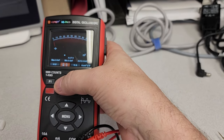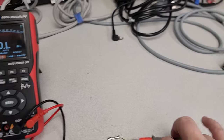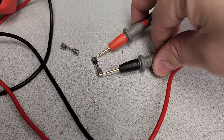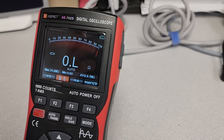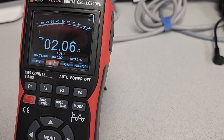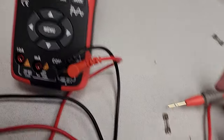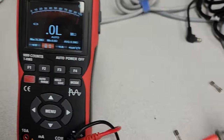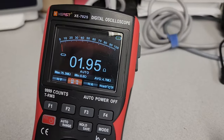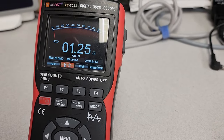Ohms is an actual measurement. So let's go ahead and pop this over to ohms. Here we go — look at this fuse. One ohm, two ohms. You see that? It's jumping around. Let's set that fuse aside and get the next one — and yeah, this is actually how I'm using it. Here we go: 1.32 ohms. You see that? 1.3 ohms.